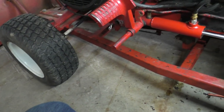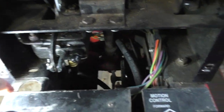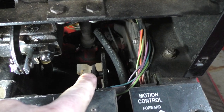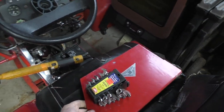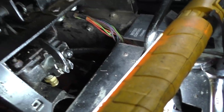The easiest way to look at this was to inspect the hoses, and I saw a little bit of shine on the hoses that was covered with grass. There's this plate here that gets into where the valve body is — you can see the valve body right there. And down there is what I think they call the trunnion, where you can put your various implement attachments. I took the four screws that hold that cover off, and I saw a little bit of oil but nothing really much coming from the valve from what I can tell.